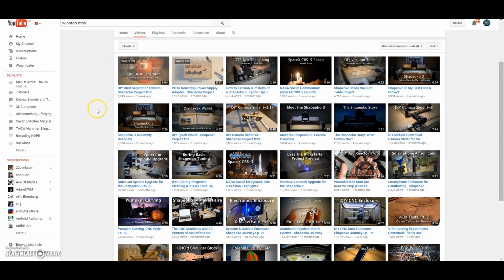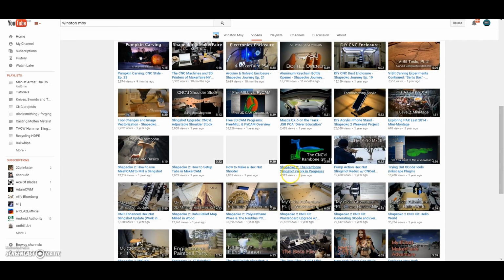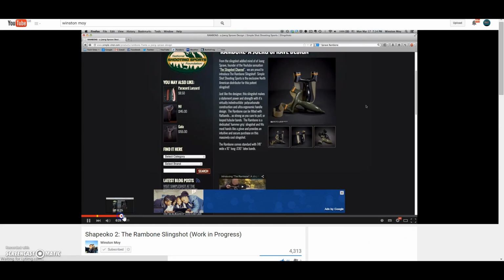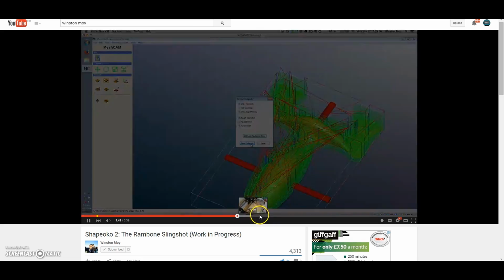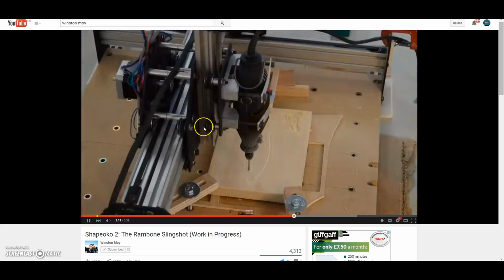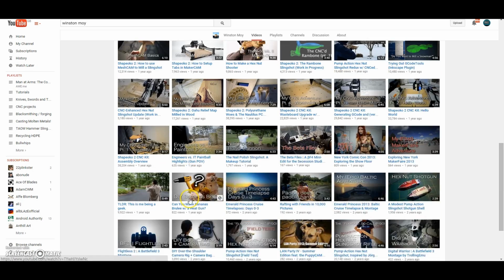So for cutting out the Rambone slingshot, I followed a tutorial by Winston Moy. This is a really great channel that I would really recommend if you're getting into CNCing, and he's got a lot of good tutorials on how to cut out slingshots and do other CNC projects, and he basically shows you the exact way to import the STL of the 3D Rambone slingshot into a program called Meshcam, which you can get a free 15-day trial for, and then he shows you how to cut it out and how to do all the toolpaths and everything, and I basically followed that.